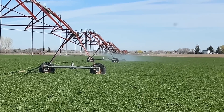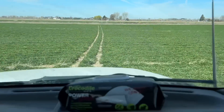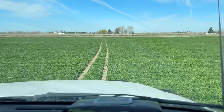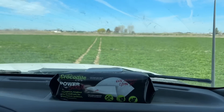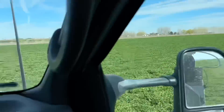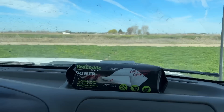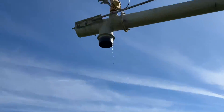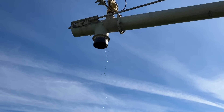The dairy wants to pump their lagoon water through here — they're getting pretty desperate, so we want to get this pivot going. We might have to clean a few of the drops too once it's running. The pivot tracks are awful driving through this field. We've got some Galileo wheels and tires that act kind of like a track and we're going to try them on a couple of pivots that sometimes get stuck and make big ruts like these — we'll make that video a bit later. This is the clean-out plug — it was packed full of mud. You have to pull that out every spring to drain it and flush it out.